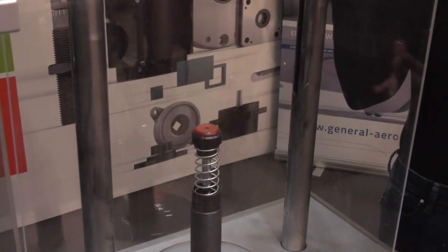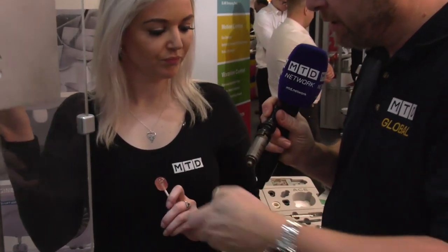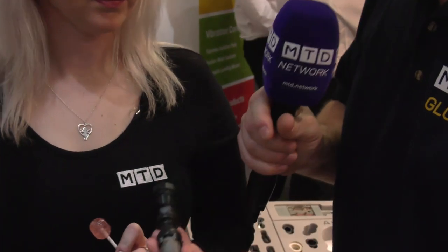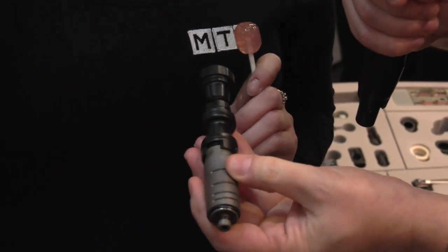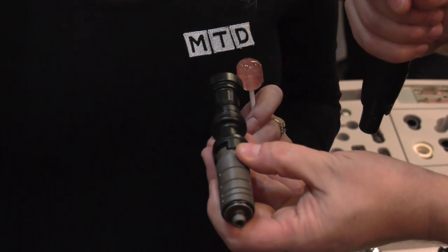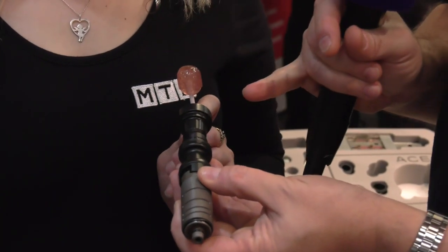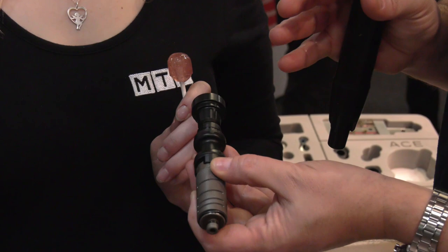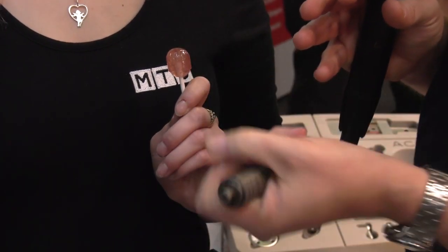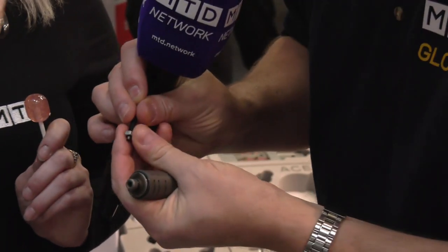Sounds good — give me some examples, Colin. Okay, well I'm going to take a step back first. I've got an example of one here — show that to the camera. This one here is similar to what's there, but you can turn this round; this section here changes the size of the orifice so that'll change the dampening effect. So if you want it really firm, like on a door, you have it really hard. If you want it soft, you might be on maybe a drone launching system as an example.